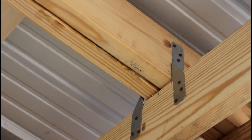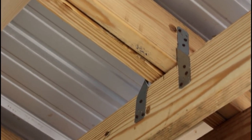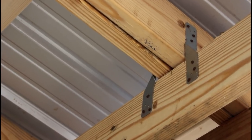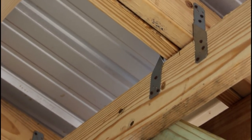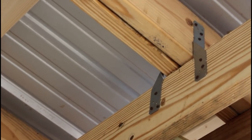These are the larger ones — we call them hurricane straps. They're twisted, and they're made to actually hold a rafter onto a girder or a top plate in a house. We've got these on each side of our lumber here because it requires this type. I'm going to show you a different style in a minute for where the lumber is just single.